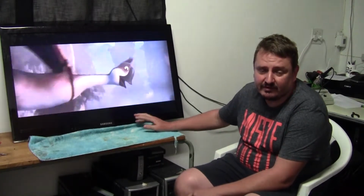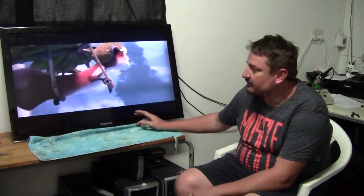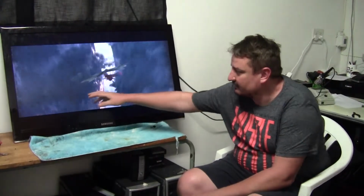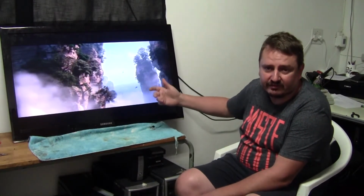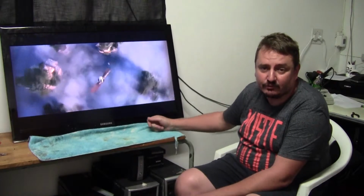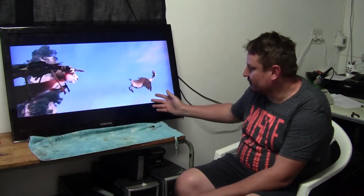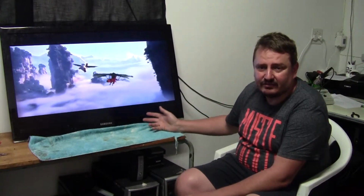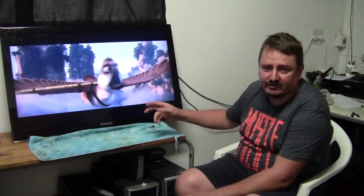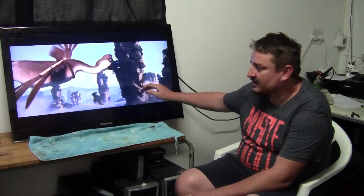So it wasn't actually anything with the firmware that needed to be updated or anything. It was merely one of the tubes that is starting to fail, one of the backlight tubes, which is drawing excess current and causing the safety to shut off. Now I can try and get another tube, but to me the picture looks reasonable, so I don't think I actually need to worry about a tube. I'll just leave it like this with that transformer bypassed, which means this tube isn't actually operating, but the picture looks good enough, so it should be fine.